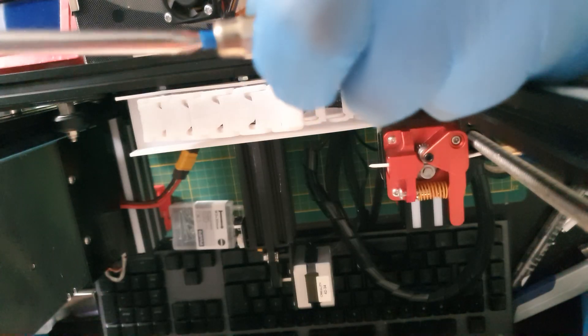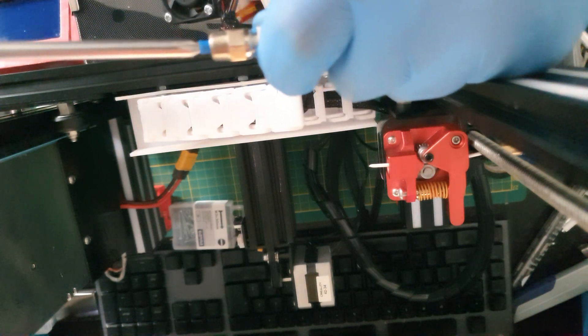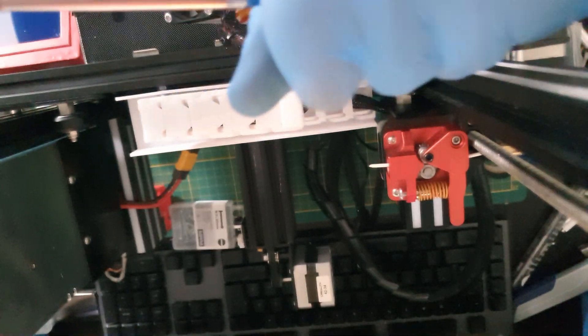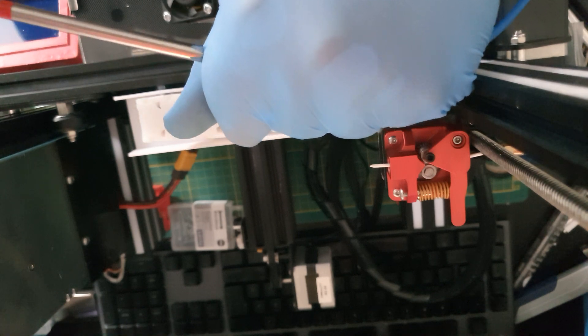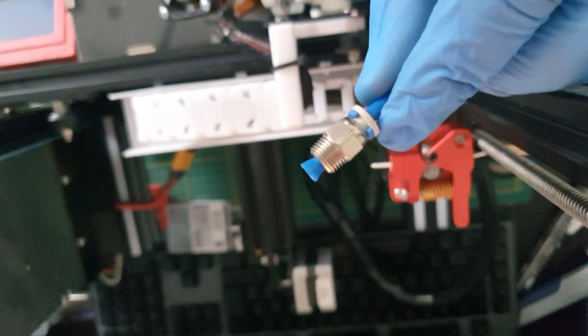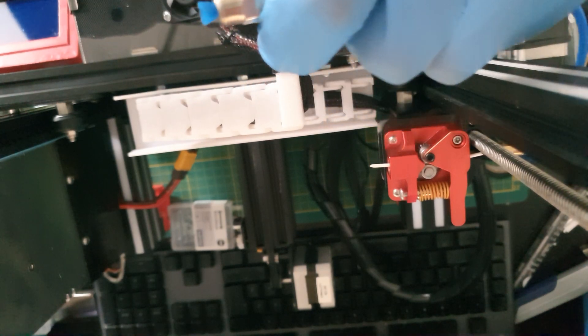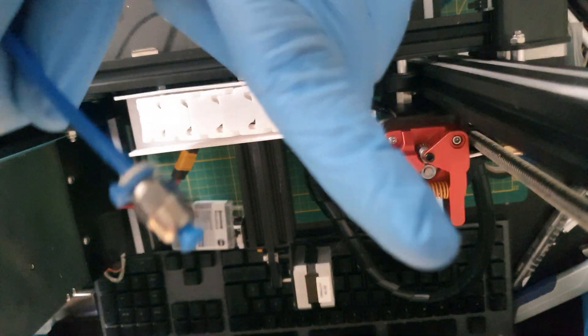Headphone warning - you're first going to heat up the tip, and once it's heated up quite a bit you will start to push it in. Heat it to get that funnel shape - watch out for your fingers, push it in and then ream it by moving your drill up and down. There's a lot of pressure. And there you go - keep going until the edges are basically almost flush with the thread. As you can see it is now cone shaped.